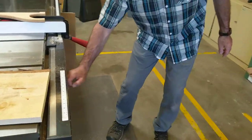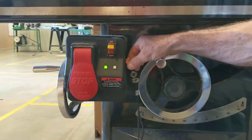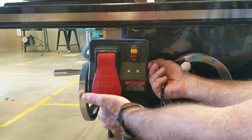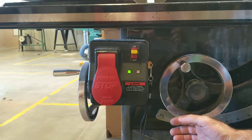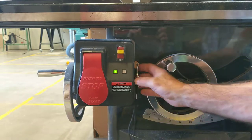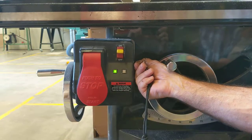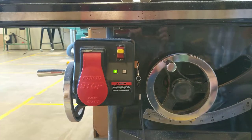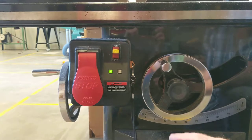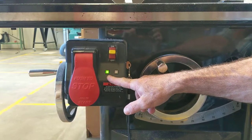Come over this way. The whole thing has to be turned on first — you have to have your key. Push the key into the lock all the way. As the key turns, you've got to turn it 90 degrees. Turn it 90 and then turn the saw on. Let the key go — it has to finish the cycle. Now it's flashing green, which means there is no SawStop safety involved. So it's a very dangerous tool now, like a regular table saw. Flashing green means the clutch mechanism will not work.